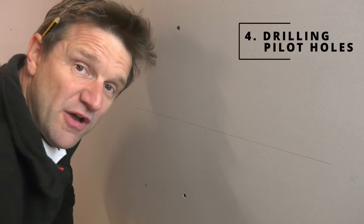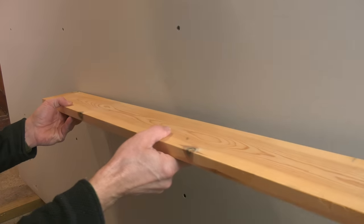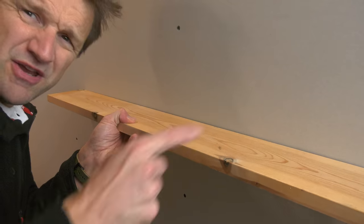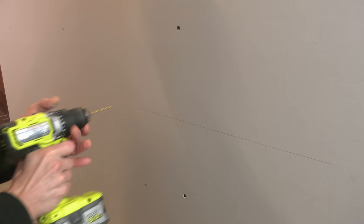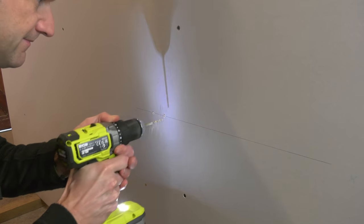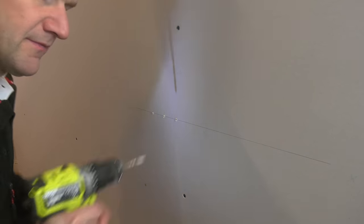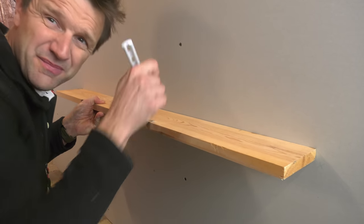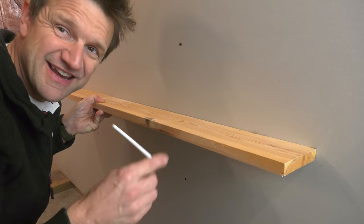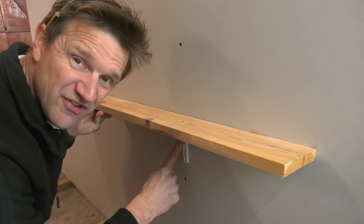Another technique we used a lot in the soft furnishings industry when hanging heavy stuff like pelmets on ceilings: if you know roughly where your shelf is going, draw a centre line — this will be hidden behind the shelf — then take a narrow diameter drill bit and probe along that line until you hit your stud. The problem is that stud isn't always in the right place for your bracket, particularly if your brackets have a decorative element. In that situation you have to rely on the plasterboard and find the best fixing for that job.